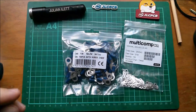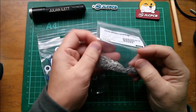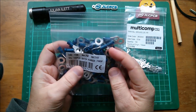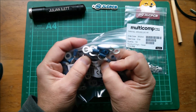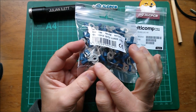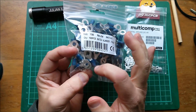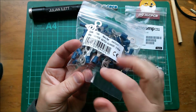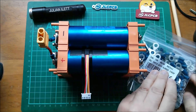Let's start with the two items I actually placed the order for. These are solder lugs which are M3 hole, and these are crimp blues. They say on them 2-6, so it's a six millimeter hole, and the other marking is 16-14, which is probably an American wire gauge for what wire will fit through the hole. The color defines the diameter of the hole, which you either crimp or, in my case, generally solder. The blue strain relief here works a bit like heat shrink - it closes up a little bit when you heat it up.